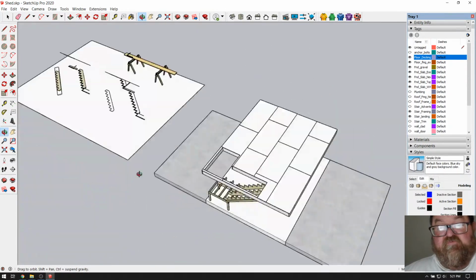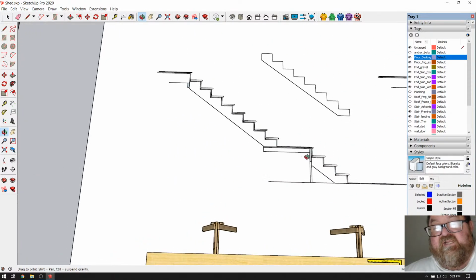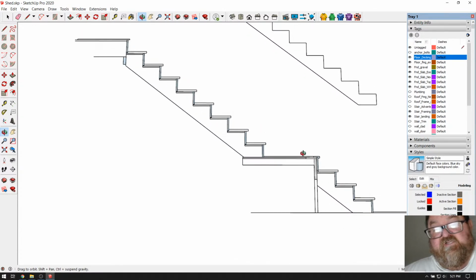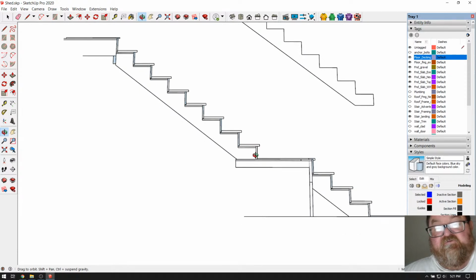So now we move over to our paper drawing, right? Because this is the whole point of planning. We want to create a stair section, okay? And when I create stair sections, I just do one straight line. Even though the stair bend turns 90 degrees, it's got a dog leg in it, I still do a straight section like this just to make it more clear.